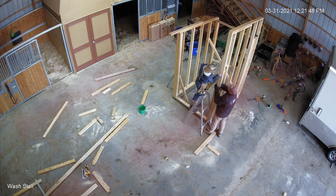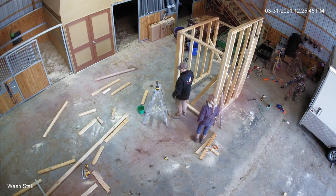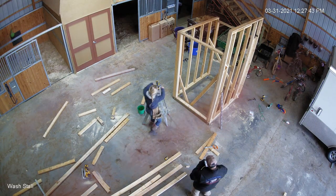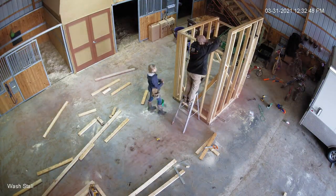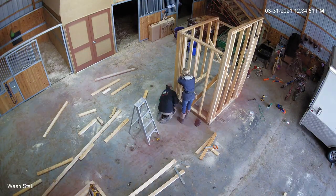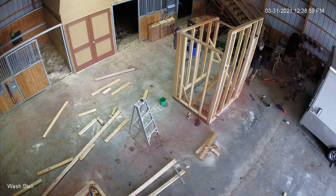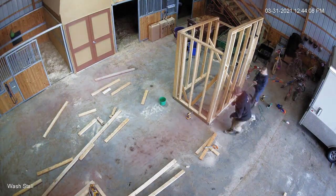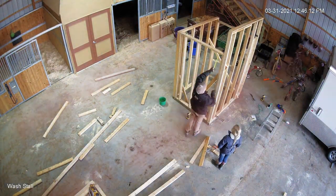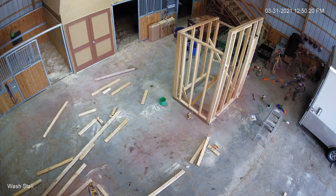Some of the wood isn't straight, so you'll see us putting the double headers up and putting the walls in — kind of torquing and twisting things to get them as straight as we can. I started this project on the ground, but we have to trailer this about two or three miles down the road to another homestead. We'll set it up for the skid steer to move it. I've got it on green treated 6x6s with lag bolts and big eye bolts on the bottom.